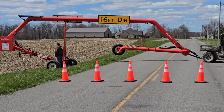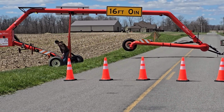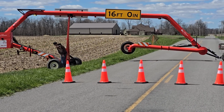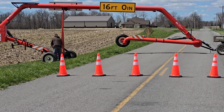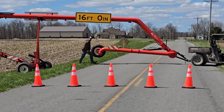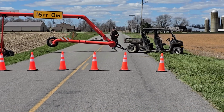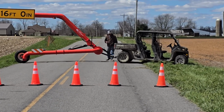So there I'm about 6 to 8 feet off the edge of the roadway, and I am now setting the rear parking brakes with the hydraulic hand pump. We added an accumulator on the rear brakes that helps keep the pressure more stable so it doesn't bounce around so much from morning to afternoon with varying temperatures. You want to set that to 1500 psi.